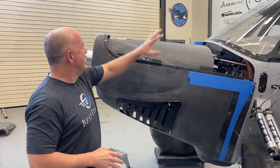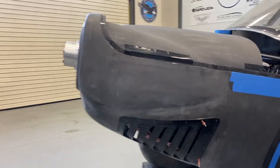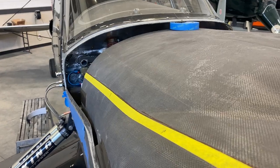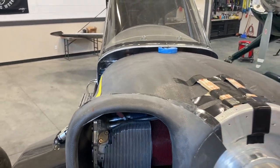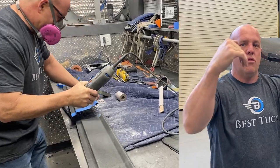All right, guys, I'm working on the pressurized plenum. I've got the top shape here. I splashed this off the top of my cowling, and then I've lowered it down just over an inch, so as the engine rocks and moves, the upper deck pressure plenum doesn't hit the top of the cowling. Now, it's run long, coming wider than the engine, so I've got to trim this line back, put on the sides that I just made for the head locker that go up and bolt down.